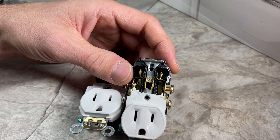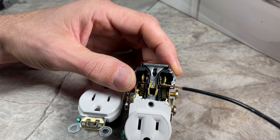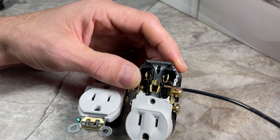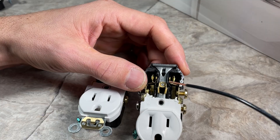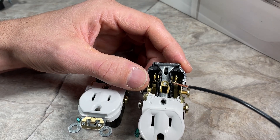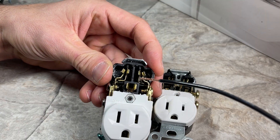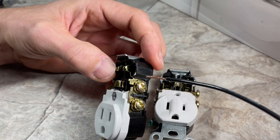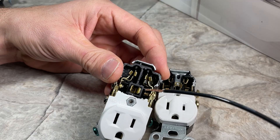I have also seen on residentials internal shorts before. With the hot side here, your plug's going to go in between and be sandwiched in this kind of U or V pattern, and that's going to be hot. You only have this small piece of black plastic separating the hot from ground. So if there's any sort of failure in that black plastic, you can cause an internal short and start to get arcing internally — sometimes you'll see black or melted plastic internally. With the commercial, you don't have that. You have a lot thicker black plastic, and your ground is going through to the external cradle. So in terms of clearances or separation between hot and either shorting to neutral or to ground, you just have much better clearances overall.